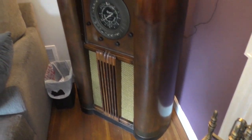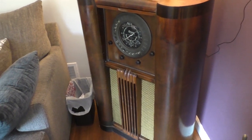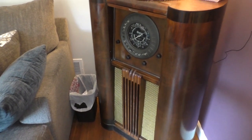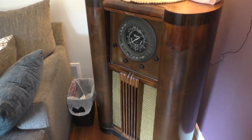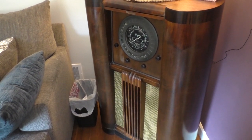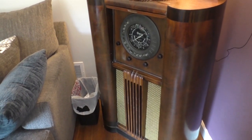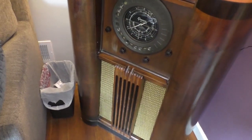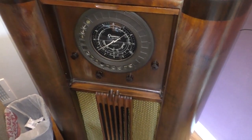The one thing I want to do with this radio — there is an auxiliary jack on the back for a phonograph. I'm thinking about using that to future-proof the unit. I want to set up a Bluetooth receiver that can output a signal weak enough that won't overpower the preamp on this unit. I actually have to set up something to test that. I'm not sure if that jack takes over the receiver or not — but if I plug something in, it's probably going to cut out the receiver entirely. There's no auxiliary position on the band selector on this.